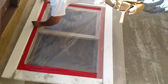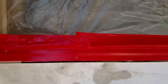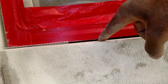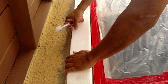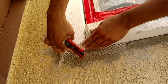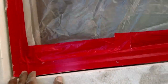Now we're going to put the mesh tape on — we already got the foam on. When we put the foam on, we left an eighth of an inch between the window and the foam so we can put the poly bond in there and it won't build up too much on the window. When putting the mesh tape on, cut your pieces and fold it on making sure there are no bubbles. On your joints, make sure they overlap — see how Louis overlapped that joint right there? That way we don't get any cracks.